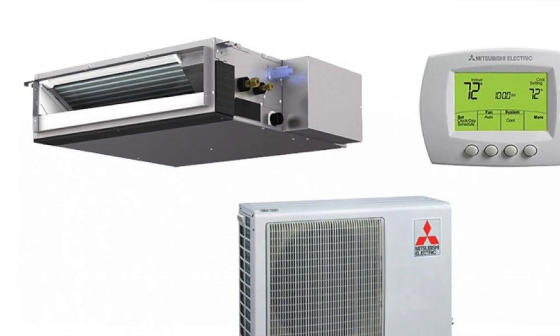The second option I would call the efficiency option. If you have a limited space and you're looking for the most efficient way to heat and cool it, I call these pancake style air handlers. They're basically designed to work similar to a wall-hung ductless unit, but now they're ducted. It's still inverter technology — it's still going to ramp up and down just like that wall-hung unit, and it's going to dehumidify a little better than the average single-stage air conditioning system. There are a few companies that make these pancake style air handlers. I know Mitsubishi has their SEZ air handlers.